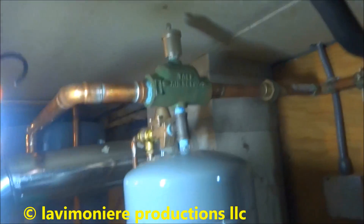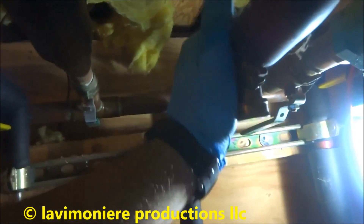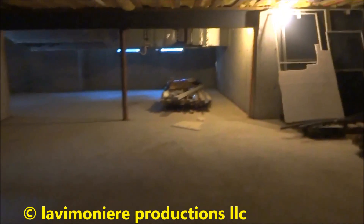The guy turned up all the zones to make sure everything's working right, and I'm getting nice and toasty returns on all of them. He said one of the air handlers — the fan's not kicking in. I think it's got something to do with the relay or the heat sensor. I'm going to take care of that, and that's going to be extra.